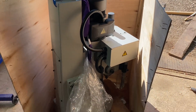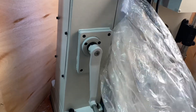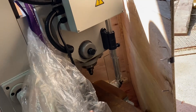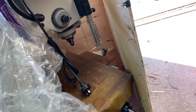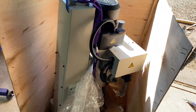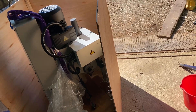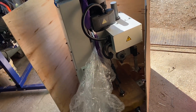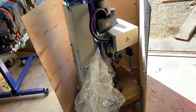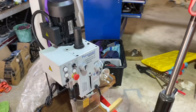This is a monstrous machine compared to the Sieg X2.7. The weight is meant to be 310 kilograms, compared to the X2.7 which I think weighs about 150 to 160. The machine is 1.1 meters — 110 centimeters — from base to the tip of the column. I've got a couple of slings in there trying to make sure I don't foul any cables, and I've unbolted it from the base. I've got it sitting on the engine stand now.